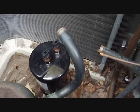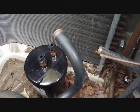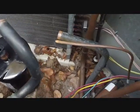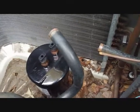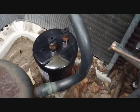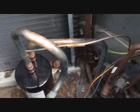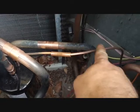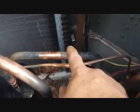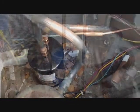I got the accumulator out and pumped down the system. It's only about two pounds left in the system — it's supposed to have around seven. I've got it cut out, and I'm going to fit the new pieces up to it, plug it back together, and sleeve that heat charging port with a 3/8 copper back into the other section of one quarter inch, and get it going. Now we've got it all fitted up. We've got the entering line to the compressor coupling back and fit back down in there. We've got a sleeve put on that sensing tube for our heat charging tube, and got it fitted up going into the accumulator. We're all ready to start brazing.